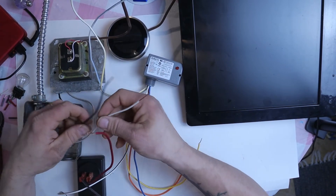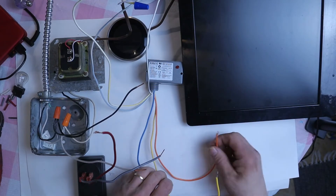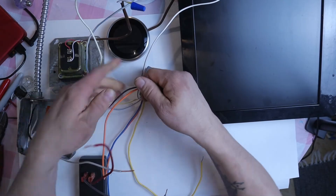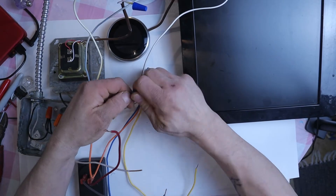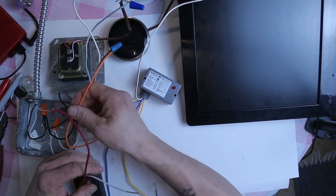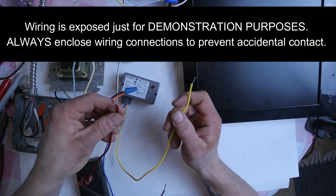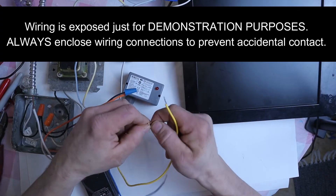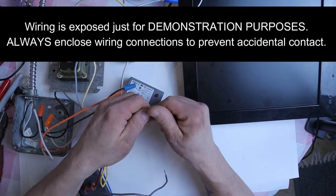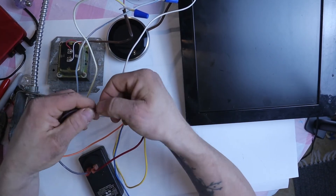What I have here is a black and white coming out of a junction box — this is the 120 volts coming off of this circuit. I'm going to hook that up to the orange wire and send 120 volts into the other side of the relay. I'm using the normally open position because I want the thermostat to be on for the TV to be on, and when the thermostat shuts off, the TV will shut off. Now I've got my 120 volts going into the load side of the relay. I'm going to take the yellow wire, and that 120 volts, when it comes out of the relay, is going to go to the hot line of the plug that powers the TV. The 120 volts goes from the power source into the relay, comes out of the relay, goes to the plug for the TV, and the common wire goes back to the white wire at the power source.